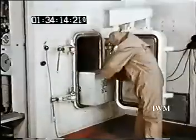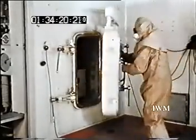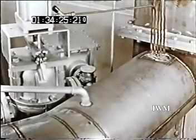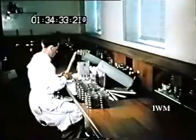Used clothing is boxed and subsequently autoclaved by an operator from the clean autoclave room side of the autoclave. Finally, before undressing himself, the controller makes the system safe for closing down by opening the breather valve in the sampling arm.